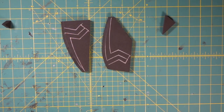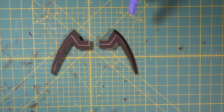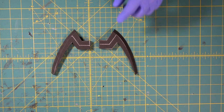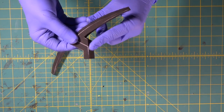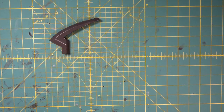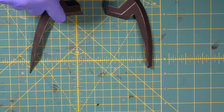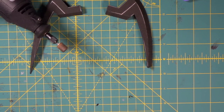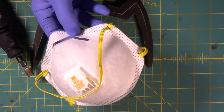Now we're going to cut the rest of this also on the bandsaw, but without the table tilted. Because we've cut this out, we can probably hit here and here also with the bandsaw. We got our outside edges beveled and were able to squeeze the inside edge in beveled too. Now what we're going to do is come in with our Dremel and sand these bevels down — which means dust mask.